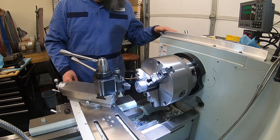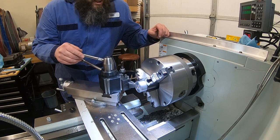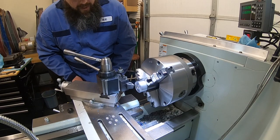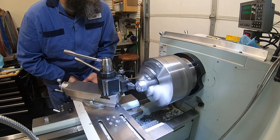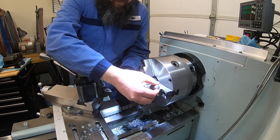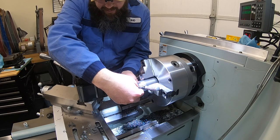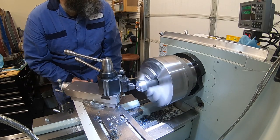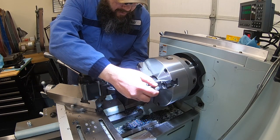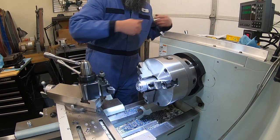This time we're going 300 thou deep, and we need to go down to 1.26 inches. Yeah, I don't know that I really left enough sticking out of the chuck to make both pieces. That's all right. We'll just go with what we've got. We're probably gonna have to move it again after. Need to take about 650 off of there to start with. Let's see what we're getting down to there. All right, I'm going for 1.260. I'm still at 1.373. So still another good 100 thou to come off of there. All right, 1.285. So that leaves us right at 25 thou to come off of there. Perfect. That's good and roughed.